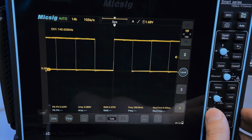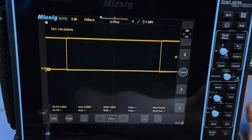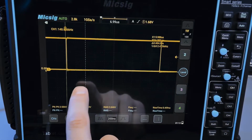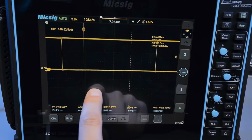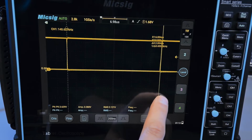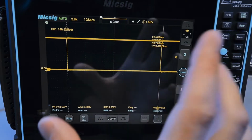So if I do that, and then I manually zoom into a waveform, let's zoom in actually even further. So I'll go here, and now I can show you cursors. So you have two types of cursors, and they have dedicated buttons, which is really cool. You have horizontal cursors, and you have vertical cursors. So for vertical ones, which is what I want, you can drag them around, just like this, but if you click, then you will end up dragging the waveform around instead. So if I drag this cursor around until I position it about here and here, I can basically read the bitrate of this particular signal, which is 500 kilohertz. And that's because this is 500 kilobits per second, and I'm measuring a single bit.